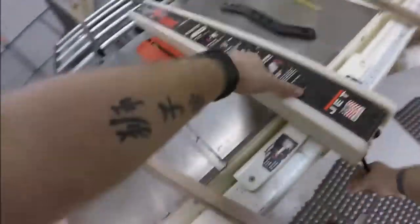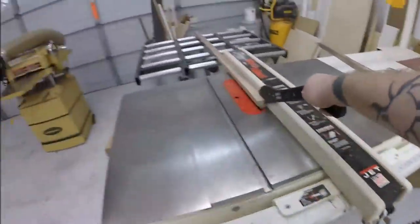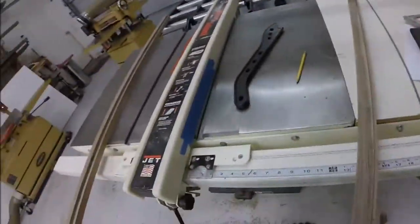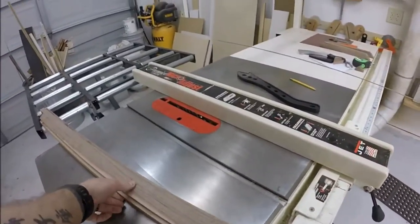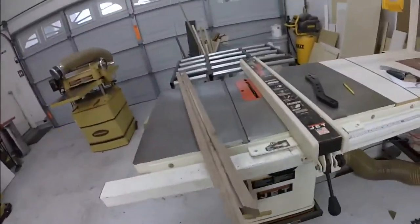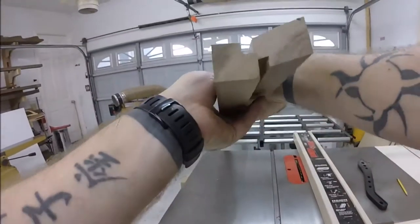This clip shows the groove-cutting process well. You start with the blade just a little past the edge of your material, cut one length, then bring in your fence and do another pass, and so on. That's the best way to do it — sometimes it's faster than using a dado stack. However, it's not 100% accurate. If you need something 100% accurate, you do need to use a dado stack. For this project, since it's not furniture and will hang on the wall where you'll never see the backside, it works perfectly and it's less time-consuming.